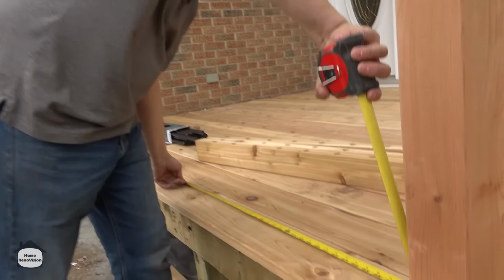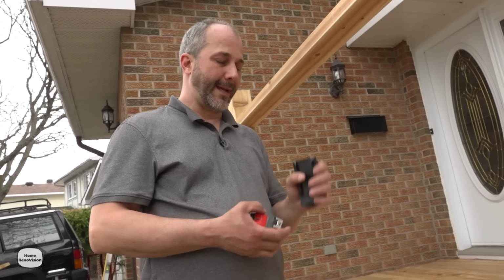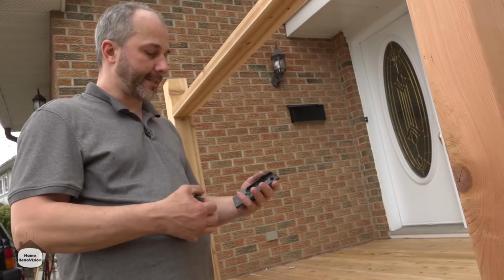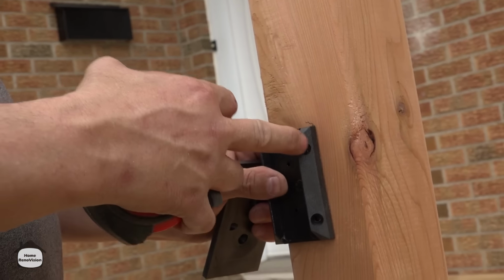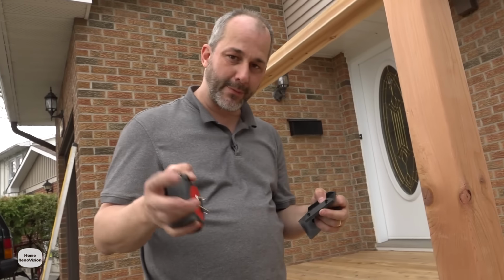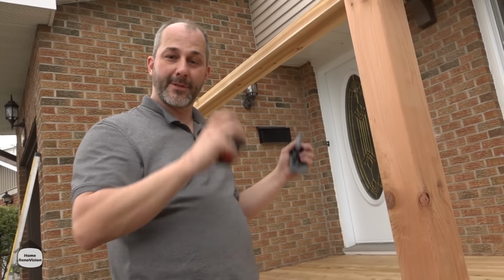Now this kit is going to throw you for a loop because it has end caps. And these get installed on the end of the rail, top and bottom, and then you set it in place. And then they have these little places here that you can actually use to screw these into the wood so that you're not screwing through the end of the wood, you're screwing through a plate. And that'll keep your rail from breaking and rotting out over time. And they're a little decorative. They're going to match the caps that are going here.